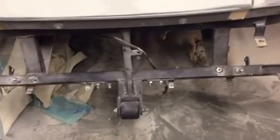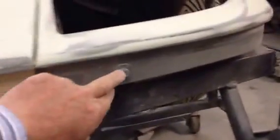Well, Rodney, here goes. I'm going to try and show you how I bolt all the stuff together on the body. Remember, I split my front fenders off, so I've got a seam here, and I got a seam over here, and at least 2 bolts, and that holds the sill down underneath the front edge of the trunk. Okay? Each quarter panel, each front fender is bolted on here and around the corner, back over here, and down here on the front of the car.